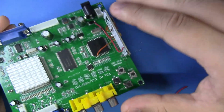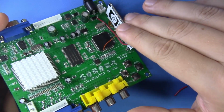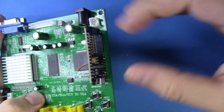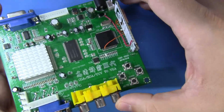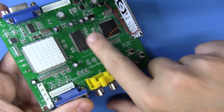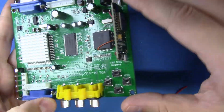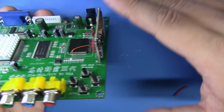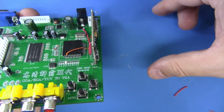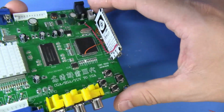Fantastic. Also, this module is now isolated somewhat from its Wi-Fi radiation, in the sense that we have this nice ground plane here and the Wi-Fi signal will more or less project out in this direction. This chip can be quite sensitive to that. So I see a lot of people take this chip and they'll either leave it in here or leave it over there. That's bad news. This is much more ideal. And also, it doesn't take up any more real estate. This board is traditionally mounted away from this device, if not over here in some way, in some place, and that just makes your form factor that much bigger.